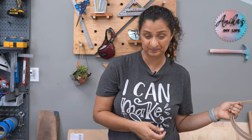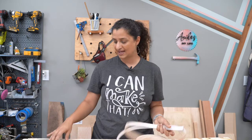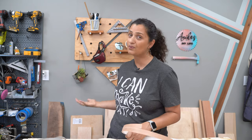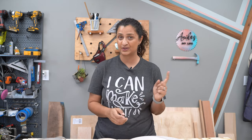The pre-applied glue makes it super easy to apply and it sticks really easily — all you need is a household iron. One of the main advantages of edge banding is that you can get it in a veneer to match your plywood, making it possible to stain your plywood really seamlessly. I have here birch edge banding, oak edge banding, and walnut edge banding that I have used in different projects. You can also get cherry and white edge banding, which you can use if you are going to be painting. All of these are three-quarter inches wide, but you can get them in various widths — I have seen one and a half inch and two inches as well.